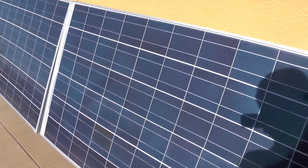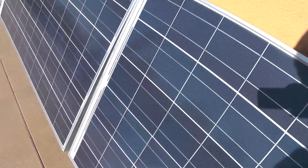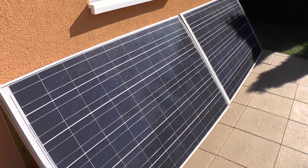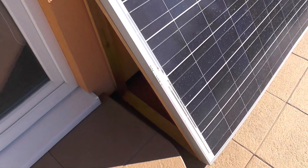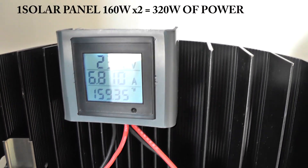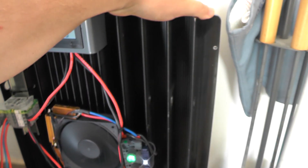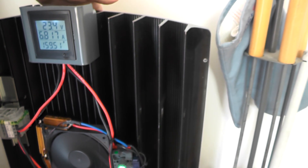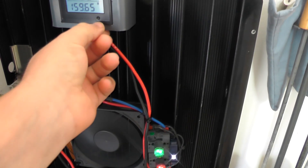It's the middle of the day and the solar panels are in almost full sun. Obviously this is not the correct angle for summer — it's prepared for winter. This was still in summer: I got about 160 watts. Now running on almost full power — 160 watts, 6.8 amps, 23.4 volts — the fans are running well. The heatsink is only slightly warm, not hot, so I think it can handle much more power than this.